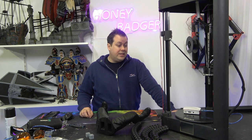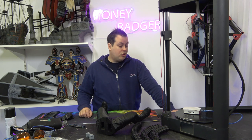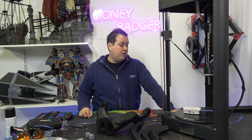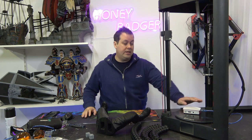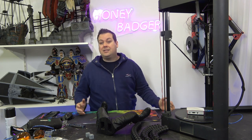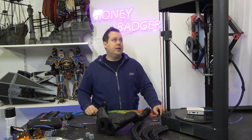We only really went with Klipper because this comes with Repetier as firmware and I don't know how to configure Repetier. I tried putting Marlin on it and it didn't go well — the bed leveling was really quite complicated. As a result, Klipper was literally the easiest way to get this working. There was a pre-compiled firmware to load onto it so that Klipper would work, and it works.